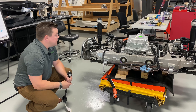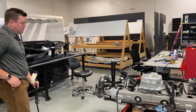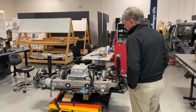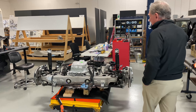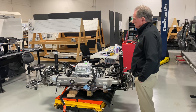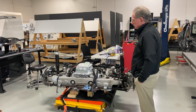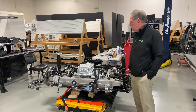Other vehicles we've seen will have a massive compromise where it'll be shaped almost like a droop and they have to go to a forging to accommodate the loads. And maybe we'll pop up a picture of what that looks like. All in all, I'd give the suspension a 9 out of 10 because I really like this style from a rear suspension standpoint. A lot of what they've done here may not be 100% like Tesla, but at the end of the day, this is pretty damn good for the guys that are working on electric vehicles.